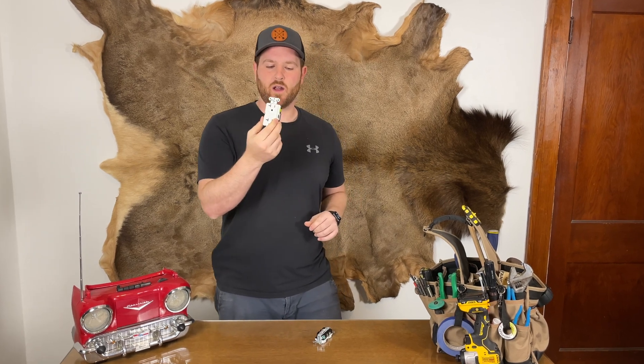No more J hooks. I researched and found that if you upgrade to a commercial outlet it too offers the back-wiring capabilities. Now what is a back wire? Back wires are not to be confused with backstabbing. The wire has so much more surface area that makes contact, plus you screw it tight rather than relying on a spring mechanism.